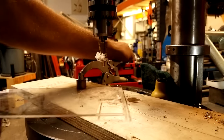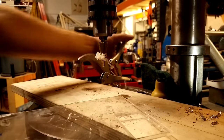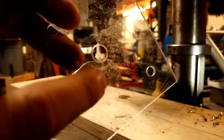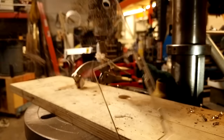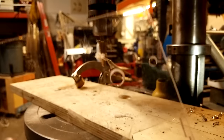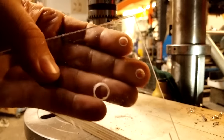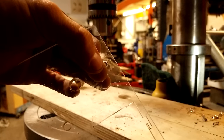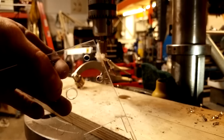I'm just going to call it there. There you go — a large hole in acrylic. With this step drill, had I continued on, you can see the hole is kind of tapered; it would have gone right through. So those are some ways to drill clean holes in acrylic: sharpen your drill bit to a point, use dish soap as a lubricant, and use step drills for larger holes, and you'll have a great time.